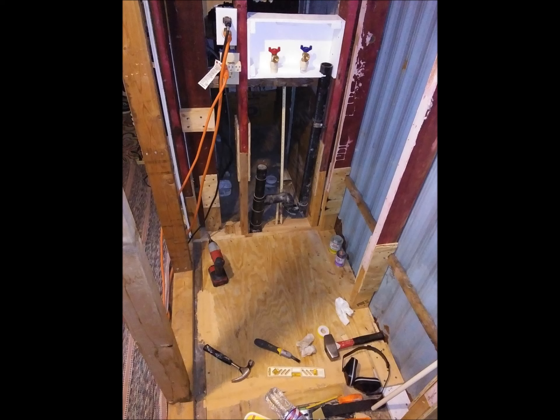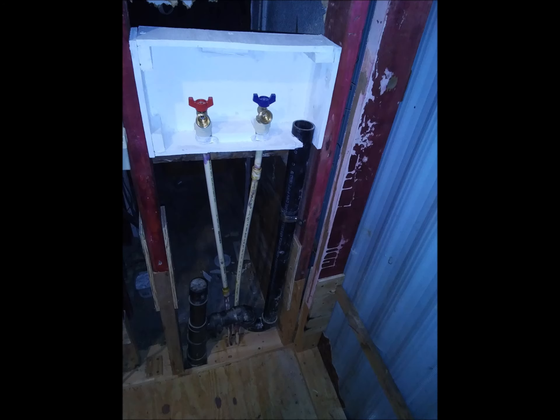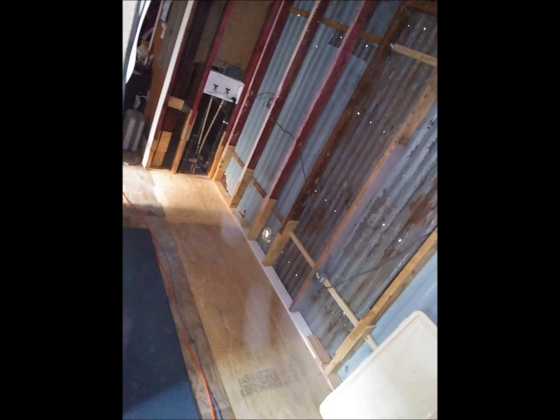I also repaired the non-load bearing wall inside this closet with gusset plates. I will be moving those electrical outlets out of the way to the proper position. And then this washing machine supply and drain hookup for the water — I just built that out of plywood and framed that into the non-load bearing wall, just to have a place to hook up the cold and hot water and then to drain into the drain pipe for the washing machine. All framed up and repaired with the sole plate and gusset plates of the 2x4s in this non-load bearing wall. Here is a back vertical picture of the area with all the 2x4s reinstalled onto the exterior wall, the flooring, the washing machine box and supplies and drain.